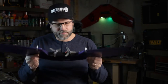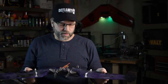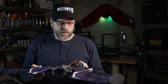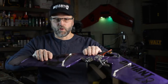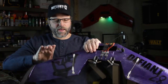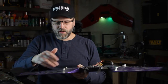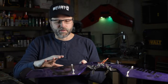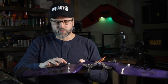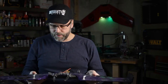If we were flying at 200, 300, 400 miles an hour, it would certainly be something we'd want to design for. The third load condition we want to look at is twist — where this wing is going to want to twist front to back. But as you'll see when we look at this a little closer, that's really nothing more than bending forces — opposite bending forces, one in the front and one in the back. So our reinforcing will take care of that.